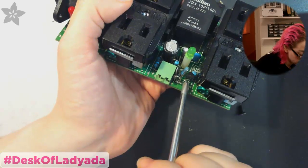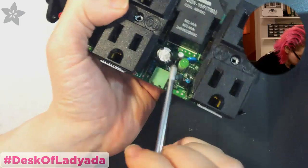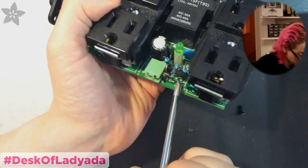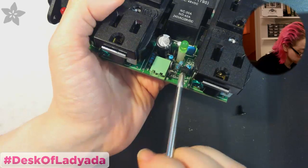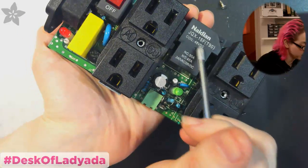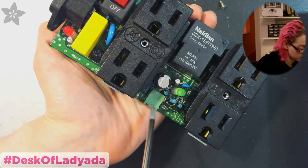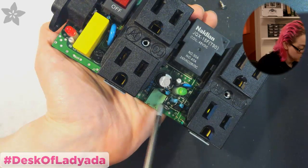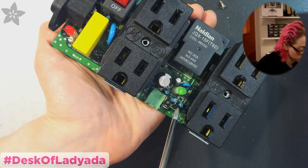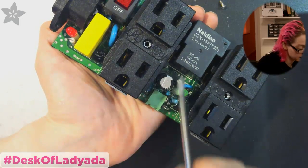And then that signal is used to switch this transistor. Probably one of these resistors is a base resistor. So this turns on and off the rectified signal from here to power this coil, because this coil needs 48 volts DC. So even if you give it 3 volts AC here, you only want the signal to control the transistor that turns on and off the higher voltage.